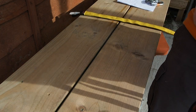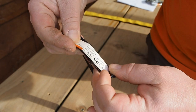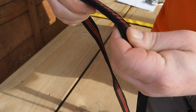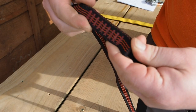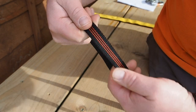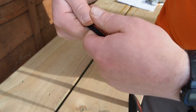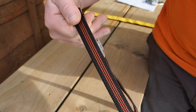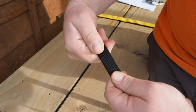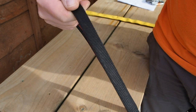The first thing I'll check on a sling is the label — I'll confirm it's one of mine with my mark on it, and look at the date and serial number to confirm it's still in date. Starting with the stitching, I inspect for any damage or wear, then work my way around feeling and looking, going slowly enough to see any damage passing in front of my eyes. I get back to the stitching, flip the sling and go around one more time on the opposite side. You should be able to feel any damage on the edges and any fluffy spots on the flat.